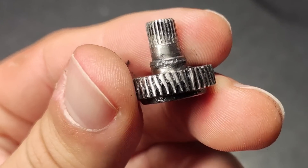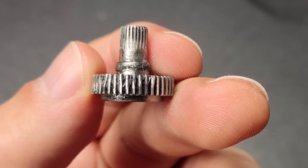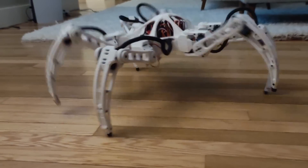Why do I even need shock absorption? Well, I've been having some problems with the metal gears and the servos literally bending under the immense pressure I put them under, so I was hoping the shock absorption will help mitigate this. My first idea was to take a 3D-printed shaft and have a metal spring go around it, like an actual shock absorber, but I decided I'd try to come up with a fully 3D-printed version first, which would reduce cost and be insanely easy to replace and change.